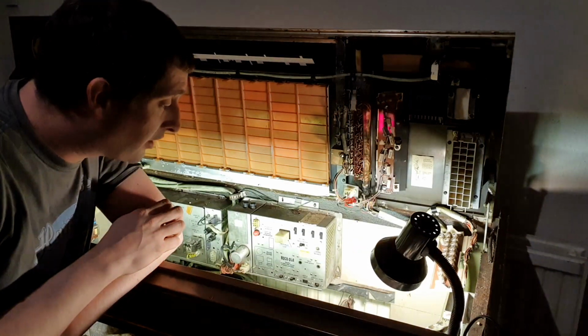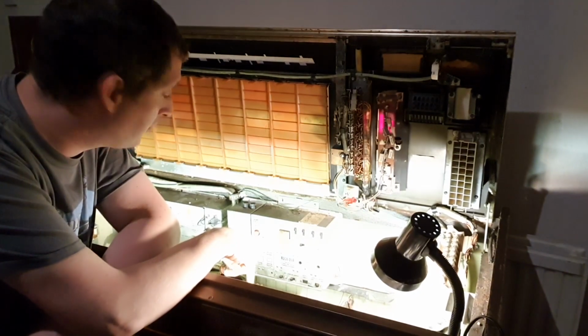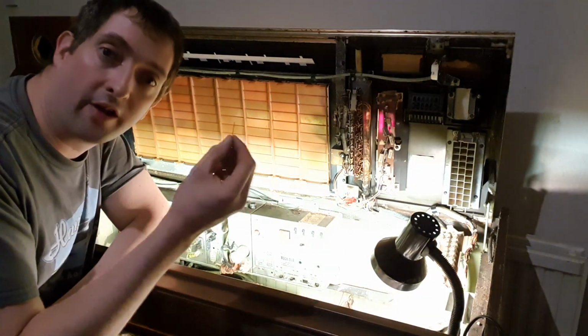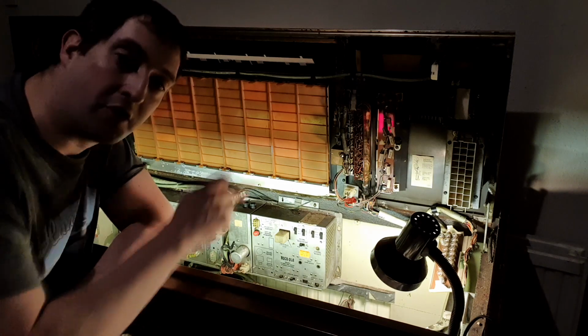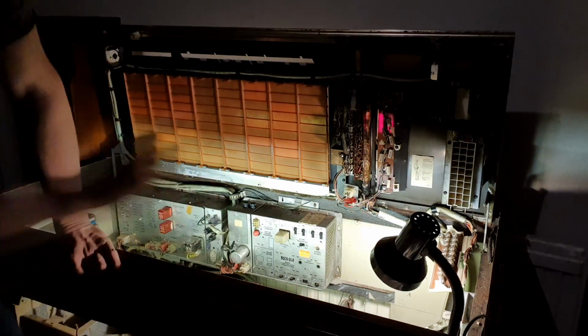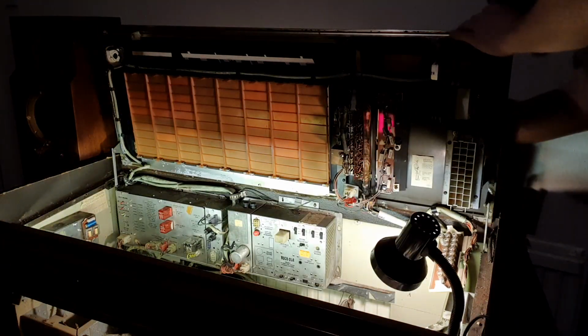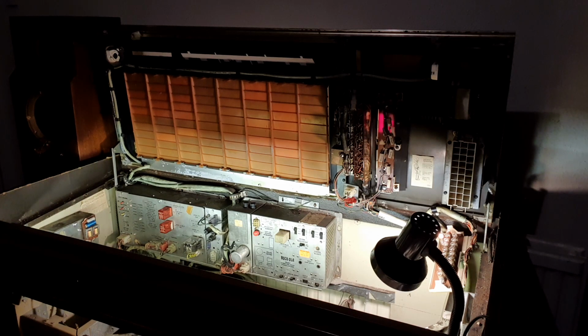I think the next thing to try is to make a selection. Now obviously we're not getting any sound out of the record because I still don't have a wire that connects the tone arm to the amplifier, but what I have got is a little bit of wire that I can shove in the amplifier input socket, and if we get a buzz out of it, we know there's some life in it. I don't think it'll make any noise until it's in the selection mode though, so I'll have to put a record on. There's something in 120. So if I dial in 120, 1, 2, 5. Okay, so that's running.